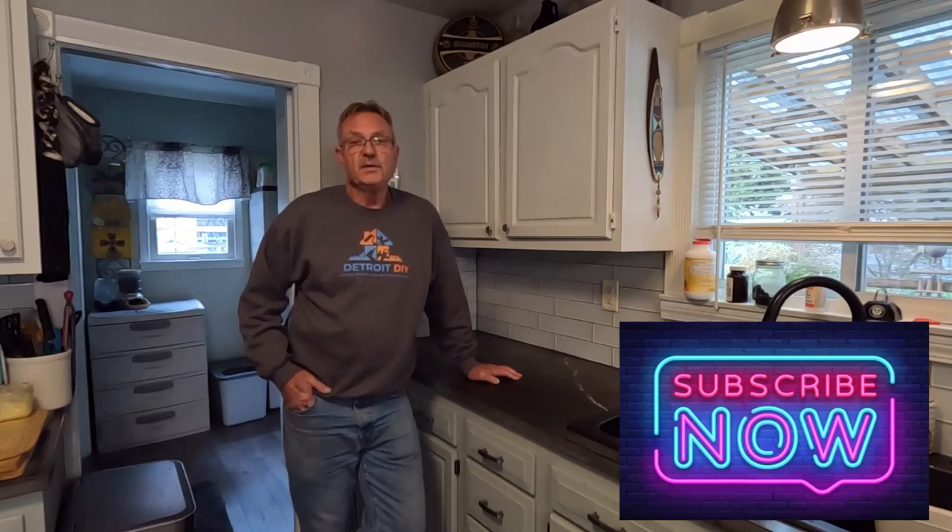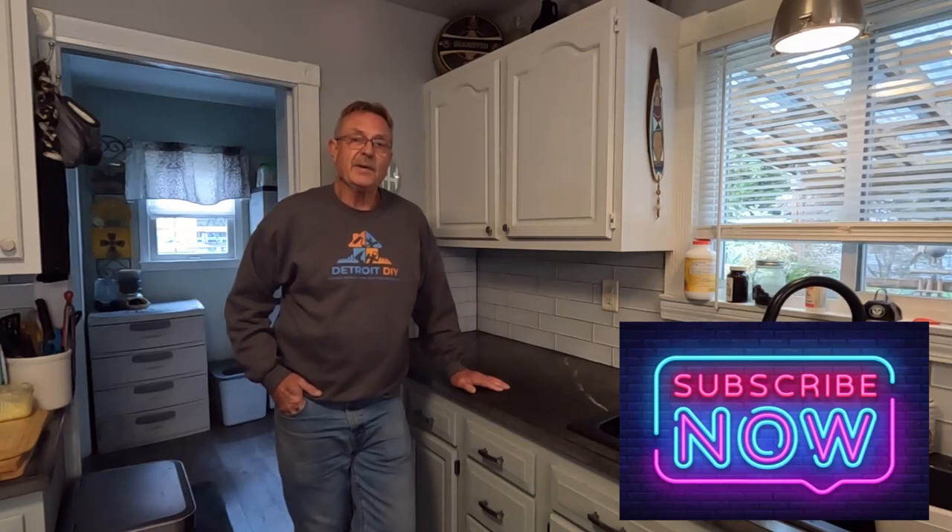The very first videos I put on YouTube two and a half years ago was the making of these countertops. I have a few problems and we're going to fix them today. When I originally made these countertops and pulled them from the forms, there were some air pockets that created voids in the surface. I filled those voids with a slurry of grout using a Portland-based grout, and after two and a half years, some of that has come out and revealed the voids the air pockets created.